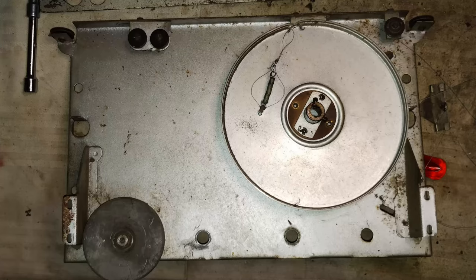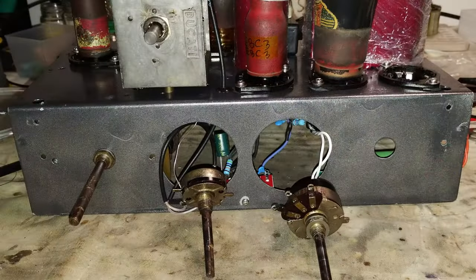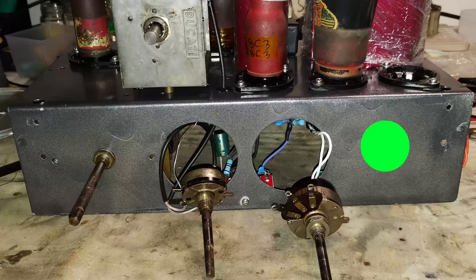The dial panel of the radio is, for its time, a standardized type with tuning flywheel and variable capacitor drum already included that could fit on Geloso chassis or compatible ones. It was made for four controls: band selection, tuning, volume and tone. The volume and tone potentiometers were expected to be in the middle, mounted directly on the dial panel, while the chassis had two big holes for connecting to them.